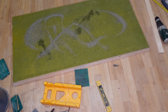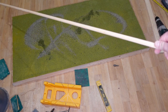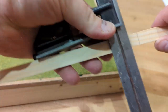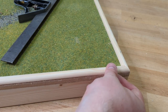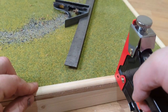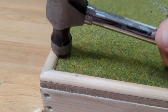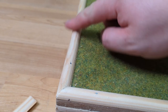You will notice it doesn't go all the way to the edges, which is what I was expecting looking at the measurements, and I've got a pretty consistent border all the way around. I intend to fix that with some lengths of this beading, and I'm just going to place that round the edges like so. I am going to attempt 45-degree cuts on these. For these strips I'm using my right angle to mark the length and then the 45 degrees to mark where I'm cutting, and I'm actually using my jeweler's saw that I normally use for minis to get nicer cuts. To attach them to the board I'm just using a few little brad nails out of my staple gun, but you could just use small nails or glue. I'm just going to use the smallest hammer I have to level any that are completely sunk in, and then give it a little bit of sandpaper. I haven't decided if I'm going to finish this with anything or paint it, but I'm pretty happy with the way it looks at the moment.